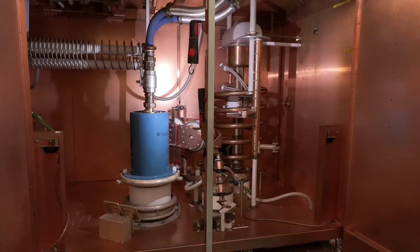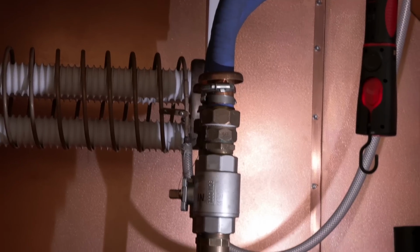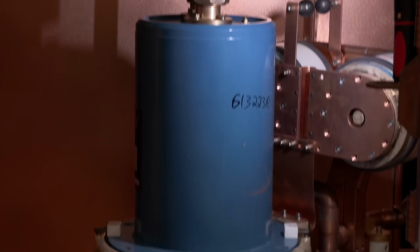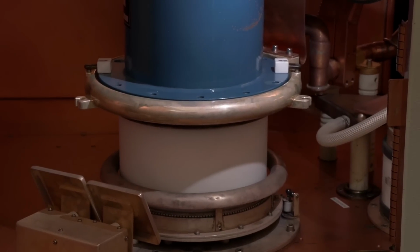Hypervapotron cooled, so very efficient, and all the cooling takes place actually on the anode of the valve. There's no steam pipes, there's no water pipes, just water goes in at the top and comes out the top. Easy, much more simple. And that is doing 250k.